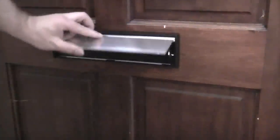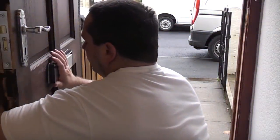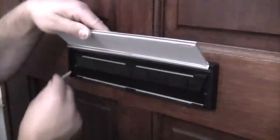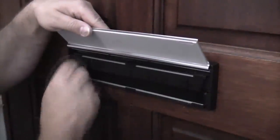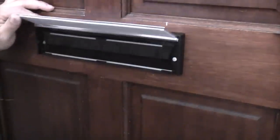Now we're going to fit the inside of the flap, which will just slot in there nicely, and then we're going to fit the front bit. We have two securing screws that go straight through into the front part which will secure it in place. We've put the gasket on the inside of the letter plate and this is now going to be fit onto the outside of the door. We take the screws that came with the letter plate and just screw these in from the back. Finally, you just need to make sure that those two screws are tight because they're what pulls the front part of the letter box forwards.